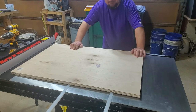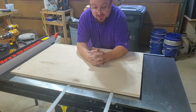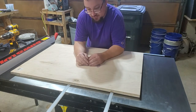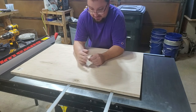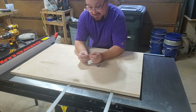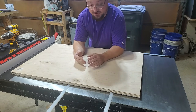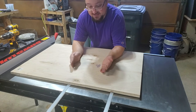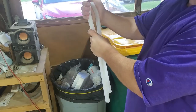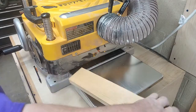That didn't work out at all. I'm going to remove them and throw them away — that was a waste of 25 dollars. Zero out of ten, do not recommend. Just make them out of wood. The problem is they're way too flexible and easily bent. When you screw them in they can snake around, and tightening the screws actually makes them expand on the sides. They're already tight in the grooves to begin with, so you can't screw them tight and CA glue won't stick to them. Let's do a do-over with wood.